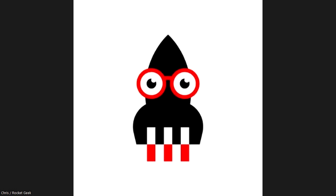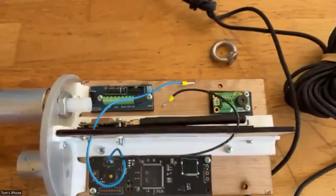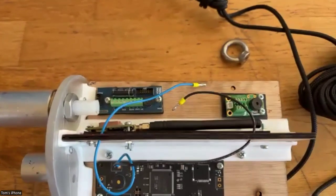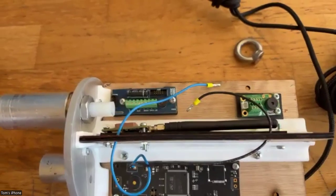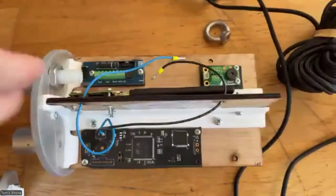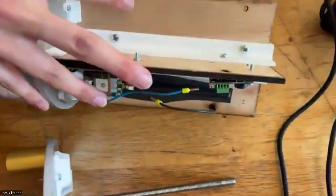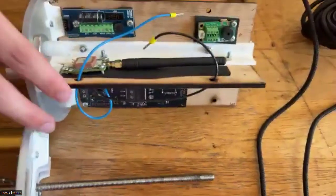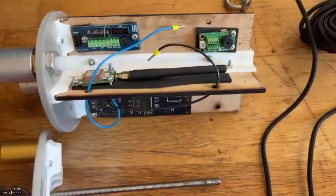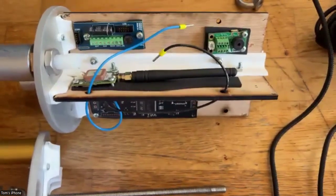Okay. How do you get your batteries mounted here? We are 3D printing our own battery holders because commercial battery holders are not reliable in the slightest. We found out they should be good enough to withstand forces. We are either going to screw the battery holders in through the plywood, in the case where there's enough room on the back of a board, or epoxy them onto the back of a board. If there's no room for screws to fit through, then we will just run the wires through the board's back and into the power connection on each component that needs it.